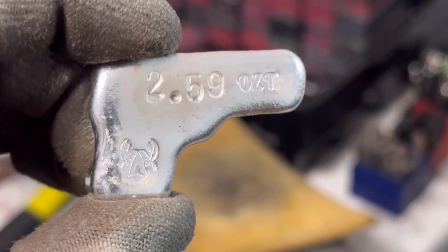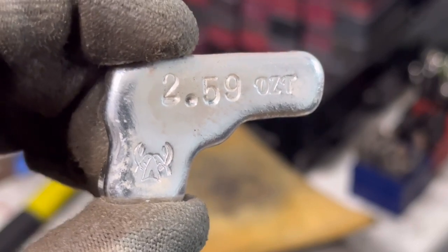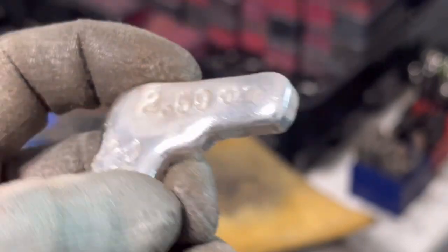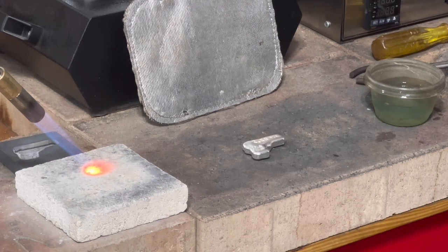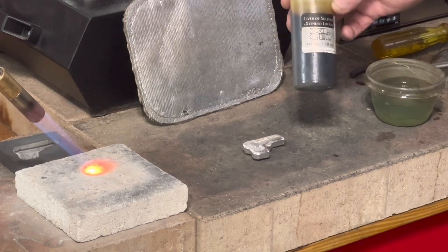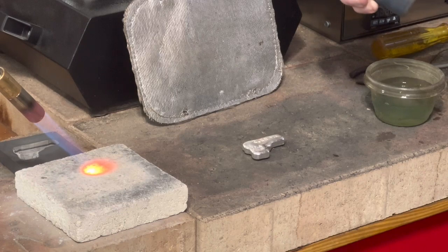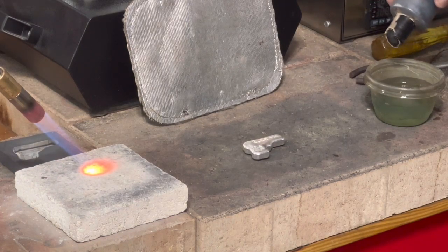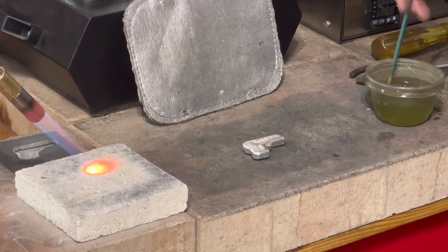Now our next step, we're gonna go ahead and darken in all the stamp parts. That way it can show after everything's all nice and shined up. Okay, I'm in my area where I normally put the dye that we use. It's actually liver of sulfur, XL gel, real good stuff, but it does smell like rotten egg when you put it in water and mix it around a little bit. So you don't want to use much of it. I got some water right here. Put a couple of drops. Mix it up until it turns yellow.